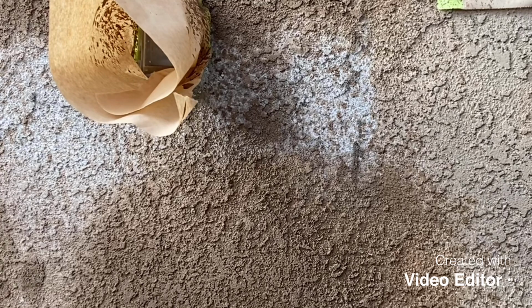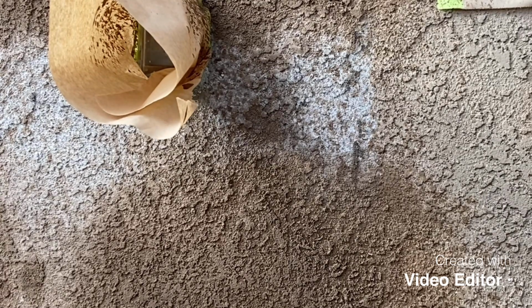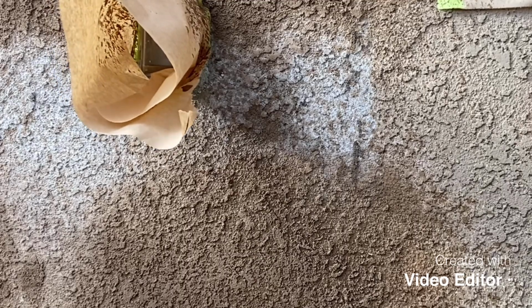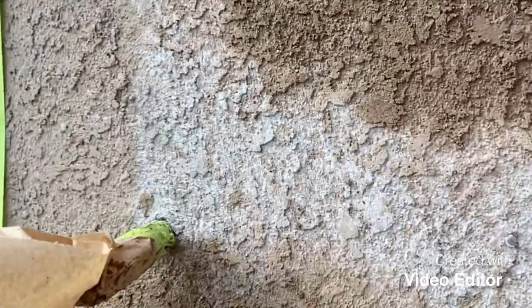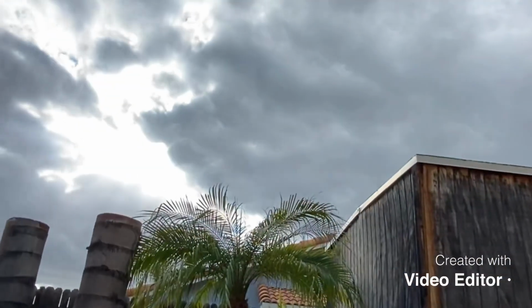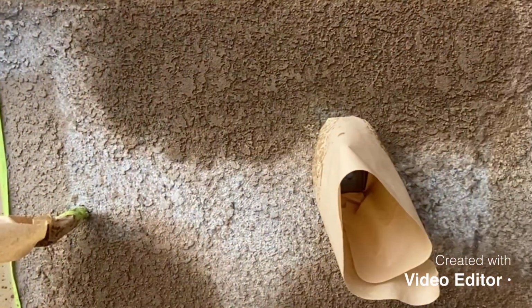So now we're gonna go ahead and put the fan on. We don't put the fan on when we put the cement, because the cement tends to crack. Stucco really doesn't. I mean, it's only 1/8 of an inch. So notice that it's just this area right here. It's wet because of the paint, but we're gonna paint it right now. It's not a big deal. So time to put the fan on, and hopefully it dries today because the sun's coming down on us. So we'll see what happens.